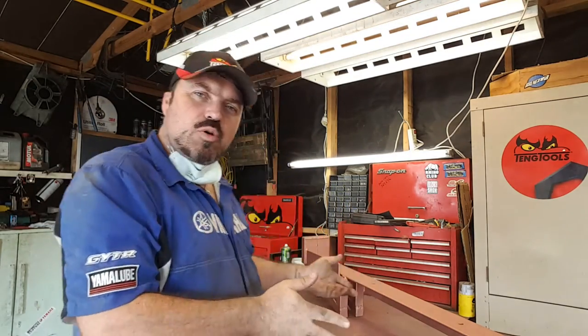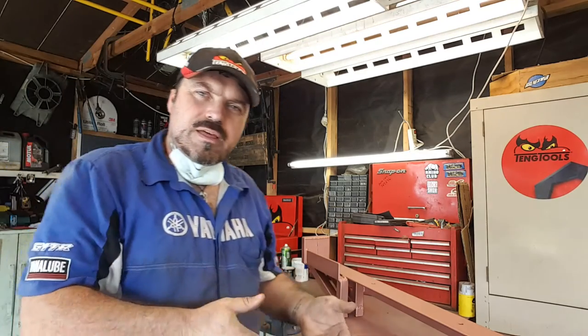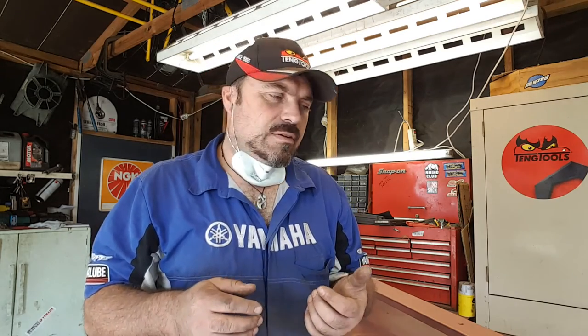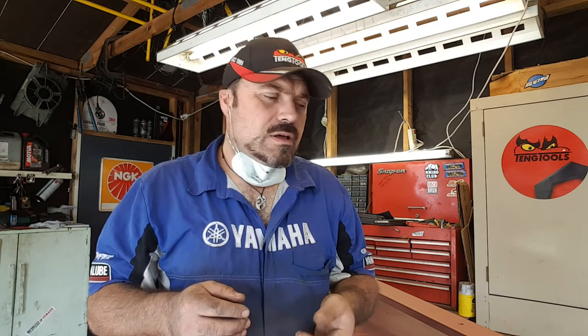Right, that's better. Okay, it's all painted in primer. Now that's a weld-through primer, so I was actually able to prime over the bits that I'm going to be welding to the truck as well, even better. So I'll let that dry, give it half an hour or so, that's all it takes for that kind of stuff. And then we're going to paint the rear, the hidden part of the bumper first, with the black gooey sort of chassis paint stuff that I've got left. I don't think I'm going to have enough to do the whole thing, but we'll give it a go.